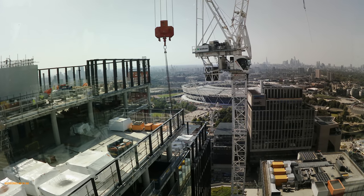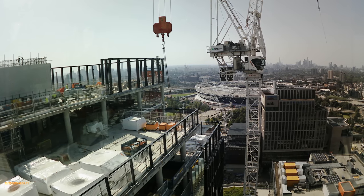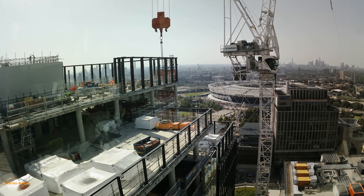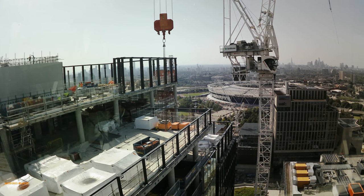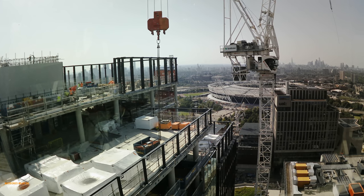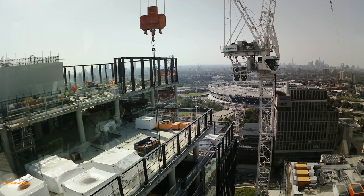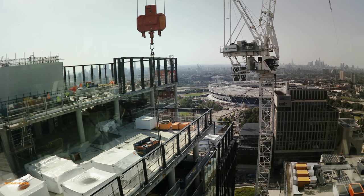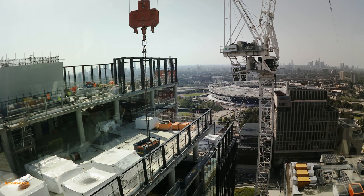This works with the jib as well. If I jib towards me, let go to slow down, let it catch up, and then go again — there's no jib swing there at all. I'll just continue with it until it gets closer. Tiny bit at the end to kill it. That's tip number three — let's move on to tip number four.